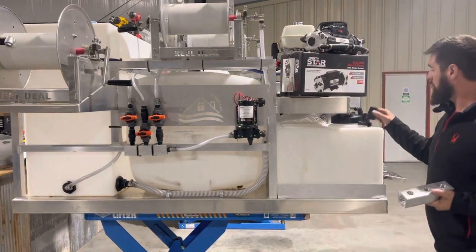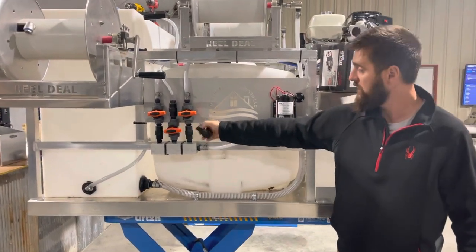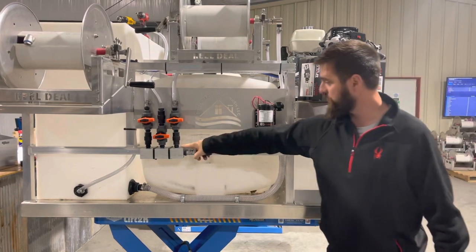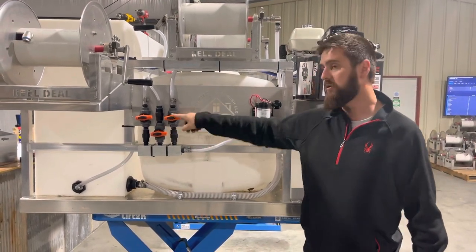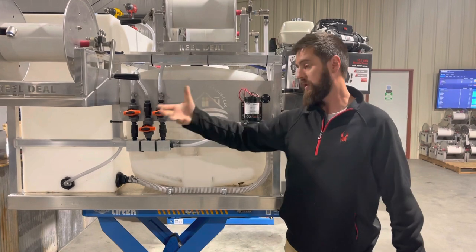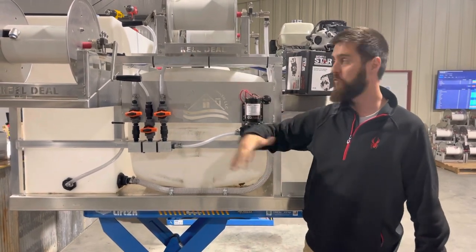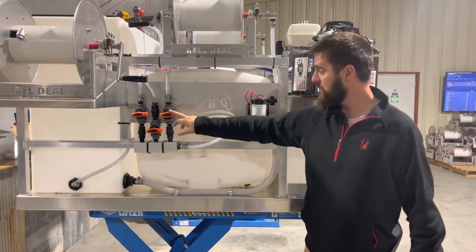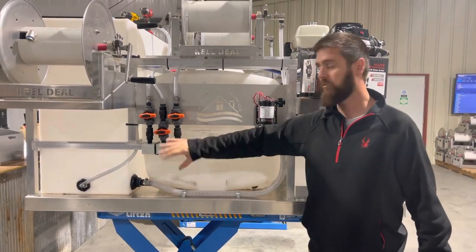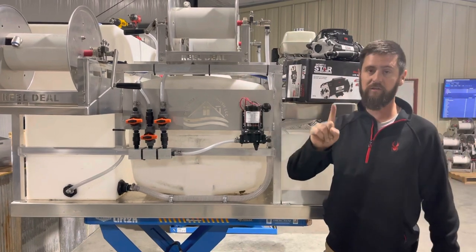Water and bleach lines, and also the outgoing port, all have to be beefed up to three quarter inch plumbing. You'll have a three quarter inch manifold leg, check valve — three quarter instead of half inch. You'll have to get one inch metering valves, and all the other barbs and stuff will be three quarter inch. Why one inch on the metering valve? Because a metering valve has a lot of flow restriction inside it, so we go up to one inch to ensure good flow for a three quarter inch setup.